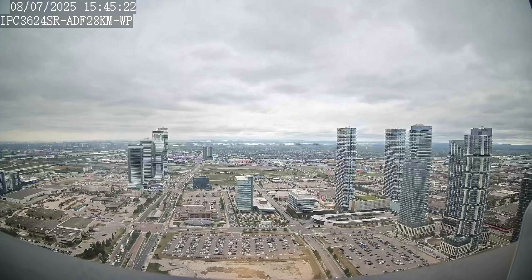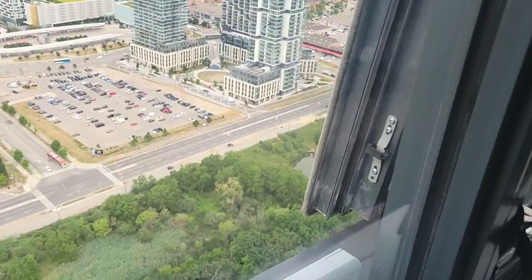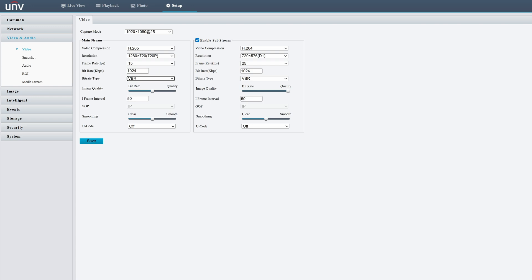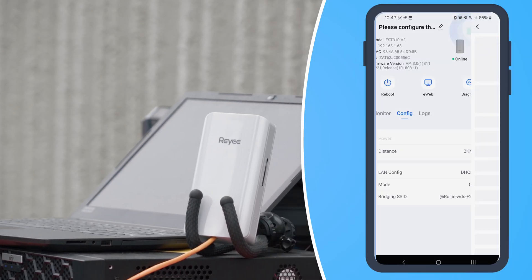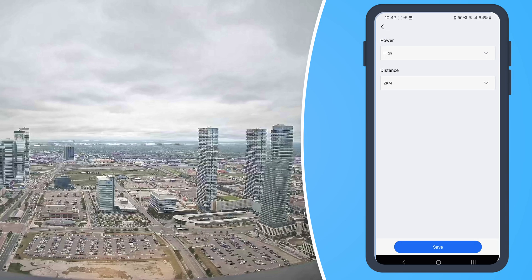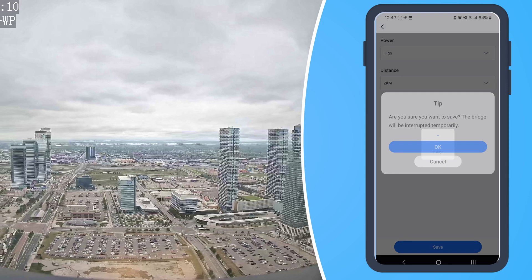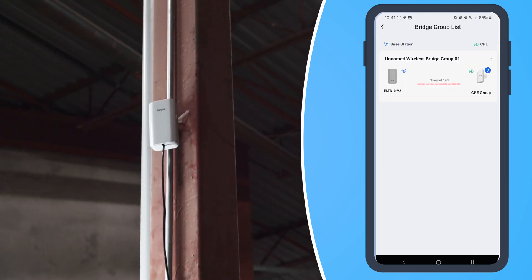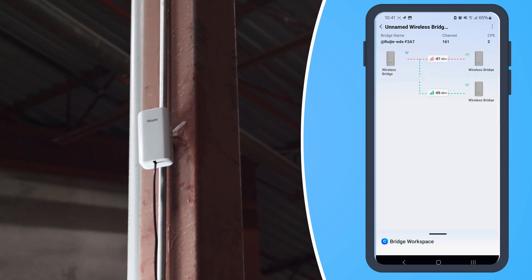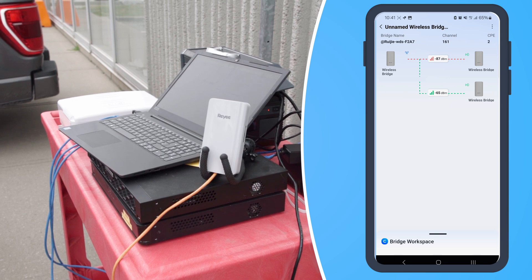Let's check out the footage — it's looking good. We're getting a steady consistent feed even with our apartment bridge's beam angle positioned outside its ideal capabilities. Because our bridges aren't perfectly aligned, we've adjusted our camera encoding settings for a smoother feed and increased the bridge's transmission length and power output. What's also impressive is our third bridge deep in the warehouse is still providing a strong signal despite all the concrete nearby and the recorder bridge facing completely the opposite direction.